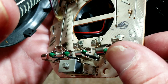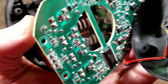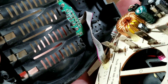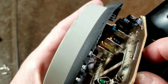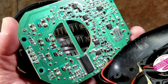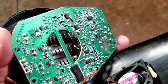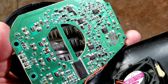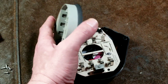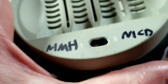What's interesting is the connectors have these little circuits in them. The AAA connectors are actually on a separate post and are physically connected to a separate circuit, so it knows when it's powering AAAs and drives less current — 900 milliamps. There's our fan and then our little ribbon cable to the LED display board. On the bottom you can see there's all these chips — the actual processor that monitors everything. These independent channel chargers really have a lot of complicated electronics inside them. I also noticed that NiCAD and NIMH are printed on the board, but they didn't do that on the case, which I thought was really strange.